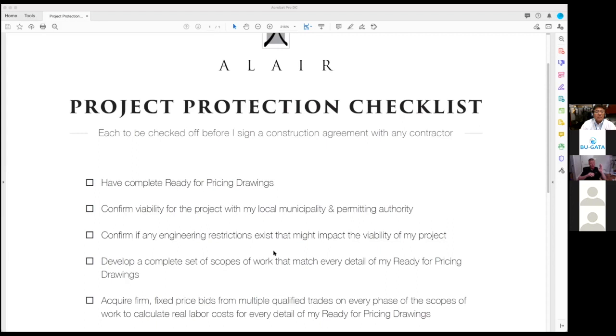And on that main floor, you can have no windows that face your property line. That also has to be a fire rated partition against the property lines. If you wanted to do that accessory dwelling unit with a full 2-story structure with a full second floor, you would have to be 10 foot off of all your property lines in the backyard. So they're great. We've had lots of conversations with them quite often.